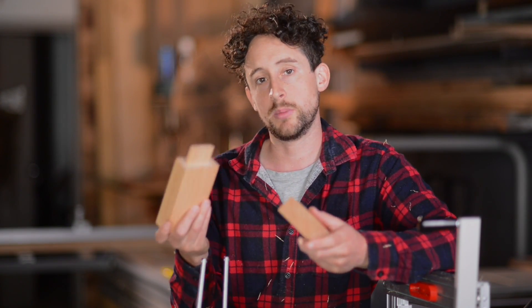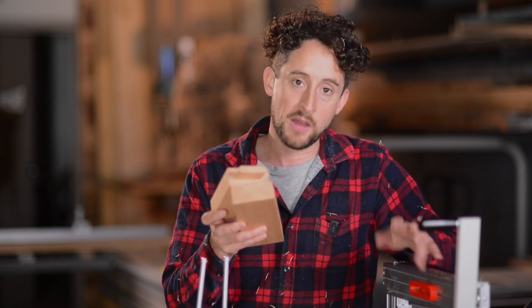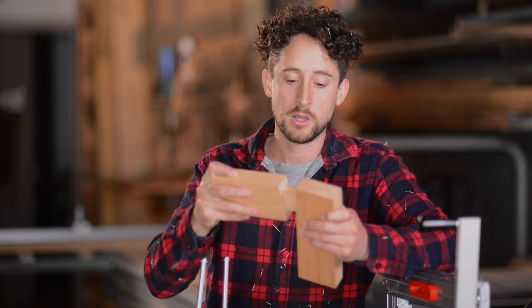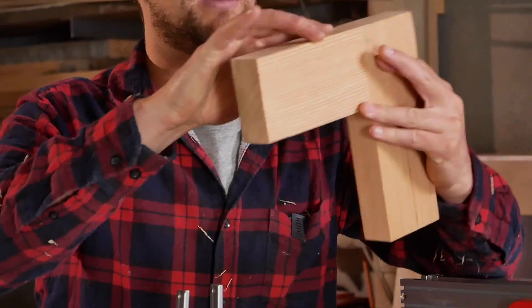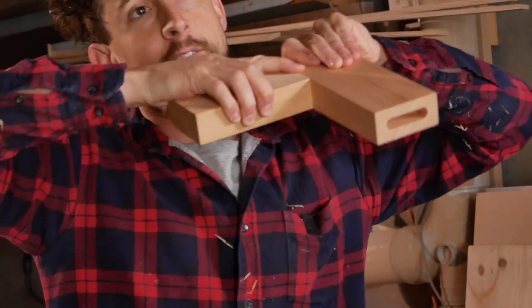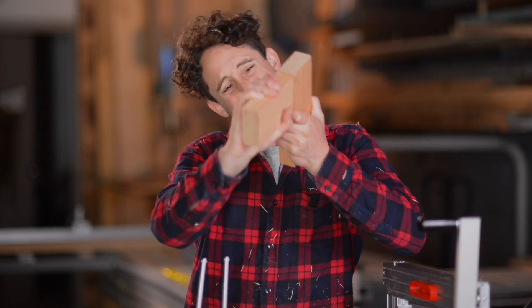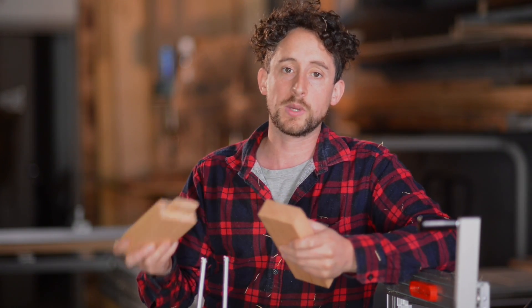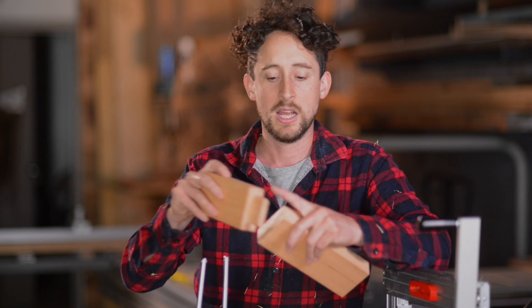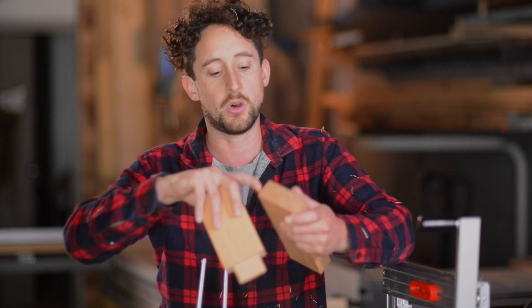I cut the tenon and measured it with calipers — it was about 13-point-something millimeters, so it was going to be a bit too tight. I moved that bearing down the template as mentioned, ran it again which just shaved off a fraction, and now it's exactly 12.4mm — it slides in there beautifully. That join is just seamless; it's firm but I didn't have to whack it in with a hammer — it's a real suction fit. If you're doing through tenons it's worth doing a test to make sure you get zero gap where the tenon meets the mortise.